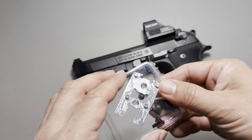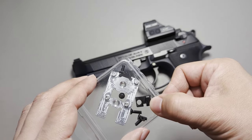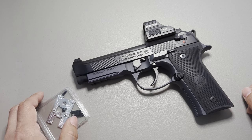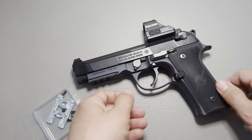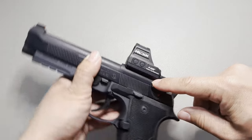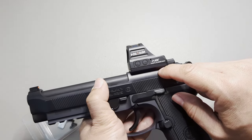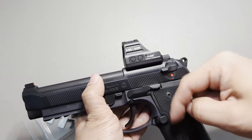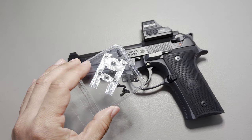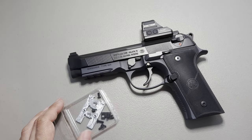You can see that the plate comes unfinished — I'm going to try to put a finish on it. You do have to install the shortened firing pin block; that's easy to do. I'm not going to show you how to do it because there's already a video on how to do it — I will link to it in the description. Basically you remove your slide, and there's a roll pin here that holds in your firing pin block. You punch out that pin, the block drops out, put in the new one, and put the pin back in. So I'm going to prep this, get it ready, do a little measurement to show you how much improvement you get, and we'll be back.